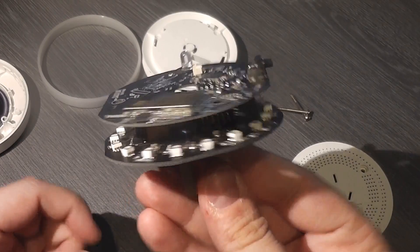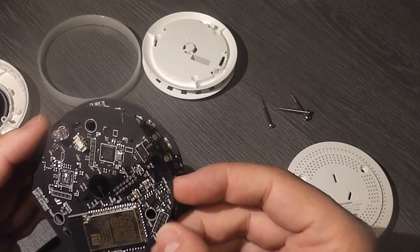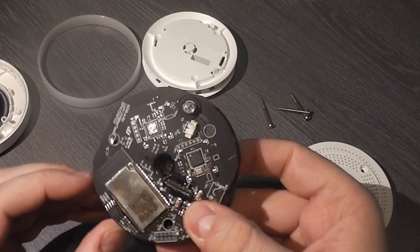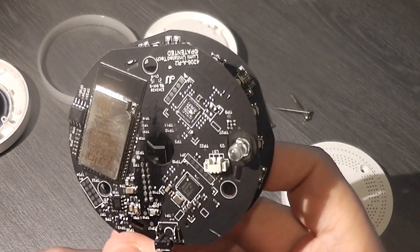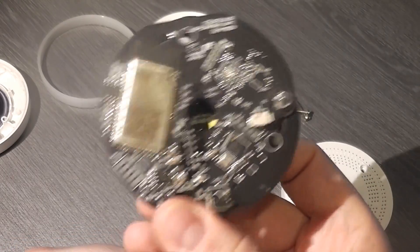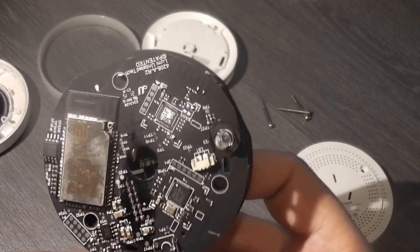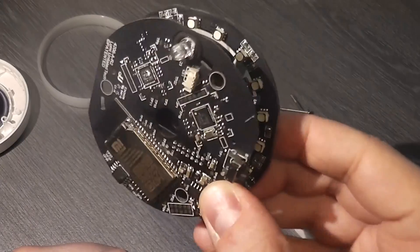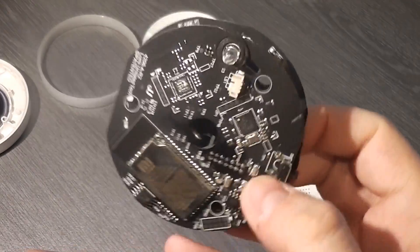I'm going to start poking around at these pins here to see if we can find some sort of debug output or serial port. Hopefully we can do something with this because it's completely closed up. I've spent a good few hours trying to get into this. There are two open UDP ports or something along those lines where the phone app sends traffic to it, but all connections out from this on a network level are outbound — there's no way to actually connect into this device. So I want to see what is running and if there's any way to make it do my bidding instead of what the cloud tells it to. Thanks for watching, and hopefully I'll have an update soon.